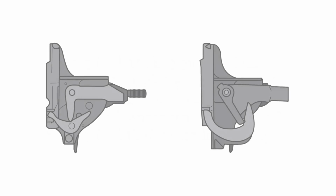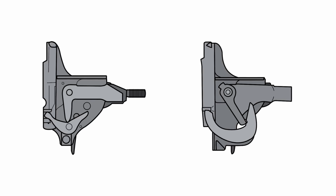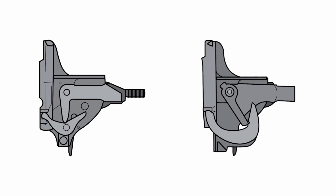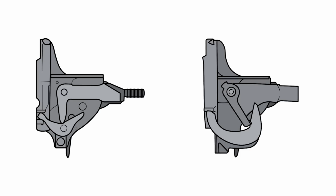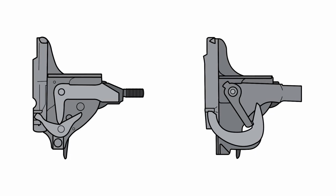The 1889 lock on the left is a mix of cross bolts and cotter pins. Several have to be pulled to disassemble, and it requires three hands to get it back together again. The 1901 on the right was designed to be taken apart for servicing on or near the front line, so there's only one split head pin tying it all together. It also had adjustable head space, which is pretty critical.